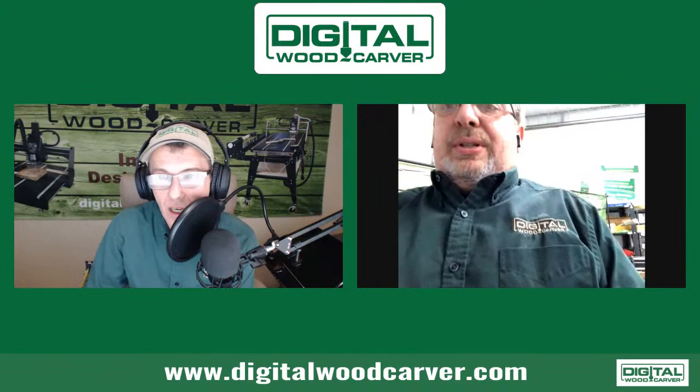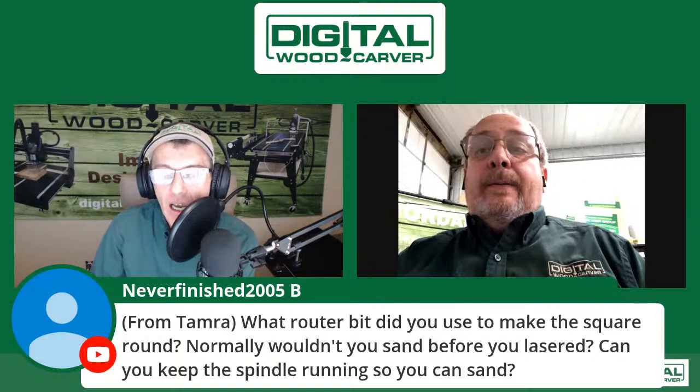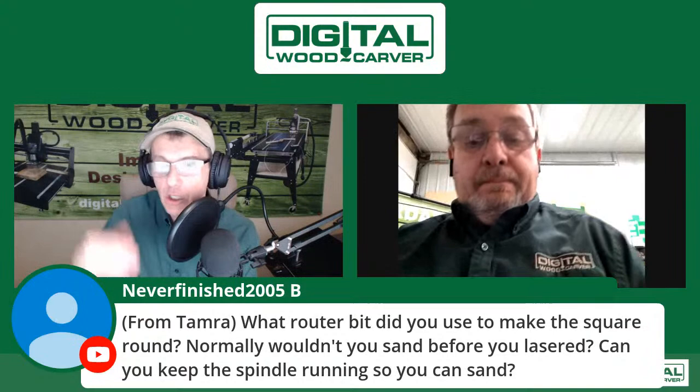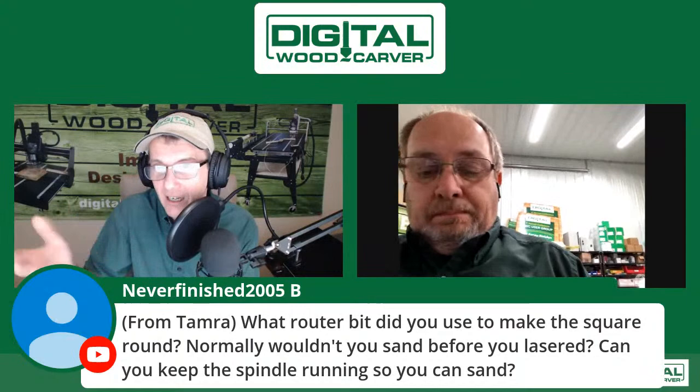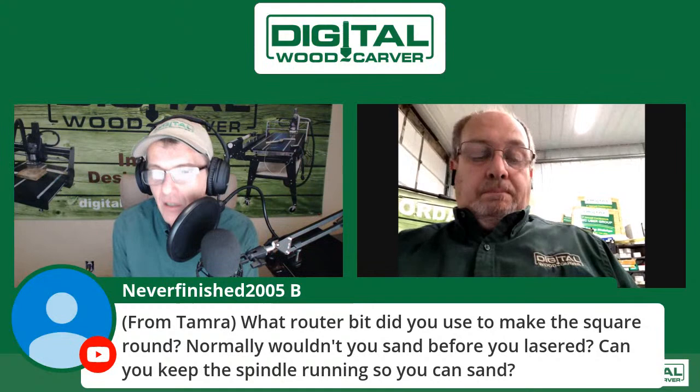Before you switch around, Burl, let's answer one last question for the day. What router bit do you use to go from square to round? Well, Burl was using a 1/4-inch end mill, but you can use any size bit. We actually kind of like the bowl and tray bits because they're bigger diameter and they have the radiuses on them. So they're actually great for going from square to round. But you can use end mills or whatever size diameter to get from square to round.